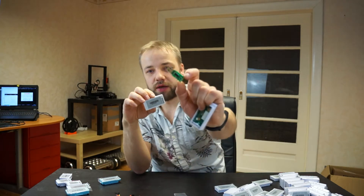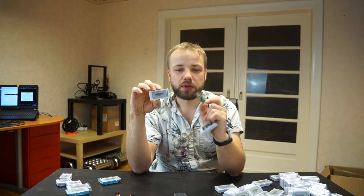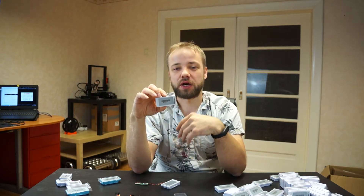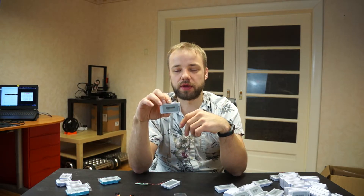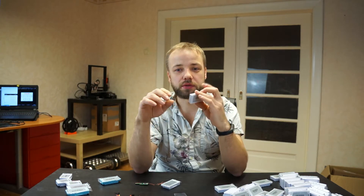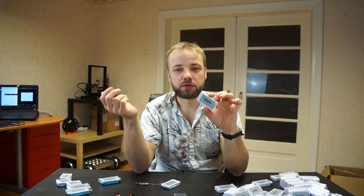I'm using a CH340 chip USB-to-serial converter. Thanks to Victor, who continued development of the Mi Thermometer firmware, we have a nice web flasher that I edited to unlock the labels and flash them via any browser supporting Web Serial. To get started, we just need to solder a few wires onto the display.